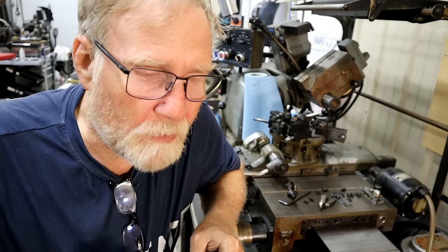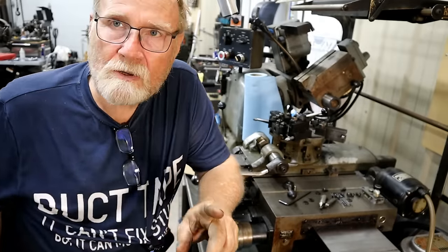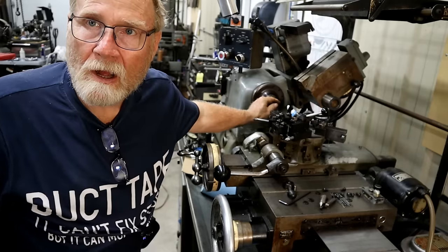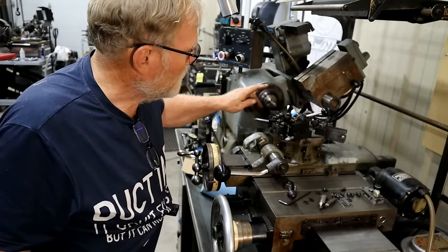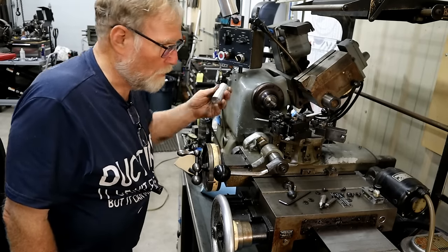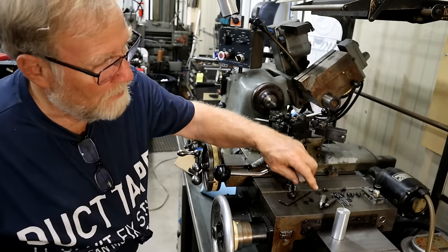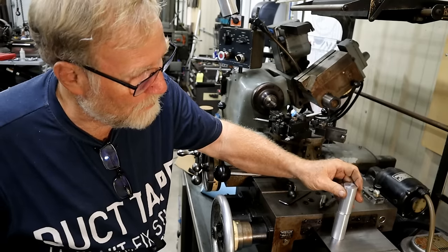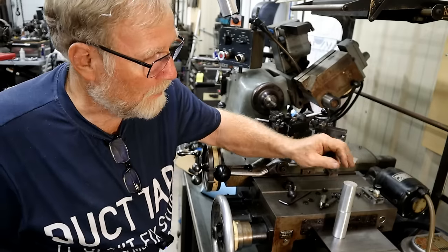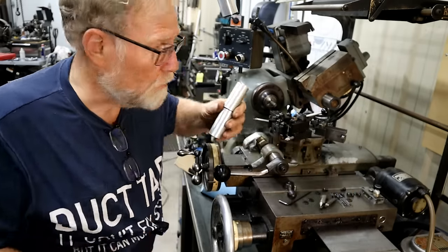I need one more thing that I've been searching for. Now, the center of the spindle is a certain height, and I forgot what it is. But Harjan makes a tool, as well, it's a cylinder like this, that is made for the height between the bed and the tool. And it's got a little top that spins here, and you can easily set your tool height on them.